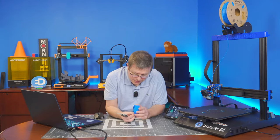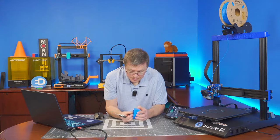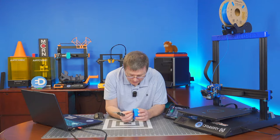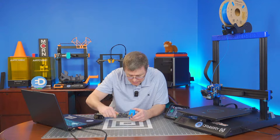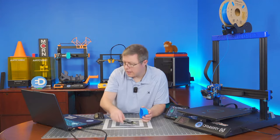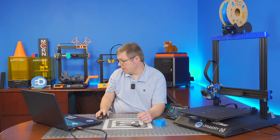Just visually look at all your corners, and then you have a seam in the back here that builds. Figure out which one looks the best. Ray says, oh wow, that's a big difference, Matt. Yeah. It's a little subjective, obviously, but we will measure to where it seems to be the best. Right about there, I'd say. So at 18.8 millimeters. Back to our G code, go to 18.8 on here.